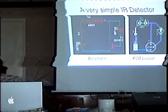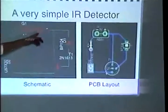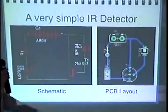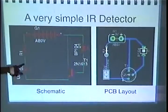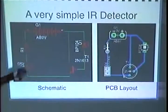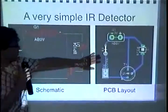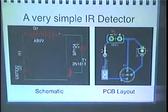This is the circuit, and basically how it works. You've got your battery right there, and you've got a transistor which essentially works as a switch. This is a photodiode, which basically lets current conduct whenever light shines on it. Over here you've got an LED that'll show you that it's turned on. And this resistor just limits current so that you don't have what looks like a short circuit. In your schematic capture utility you would draw this out, then switch to a PCB layout. This is an example of something you could print out — you'd first print the wire traces, the blue and the green, which is what you would transfer onto the copper.